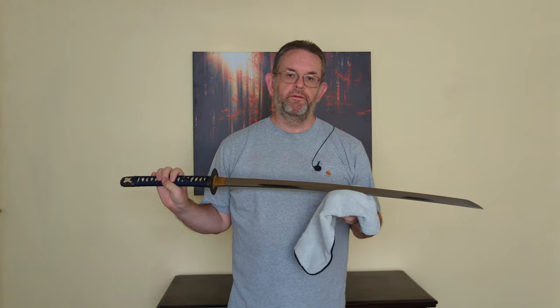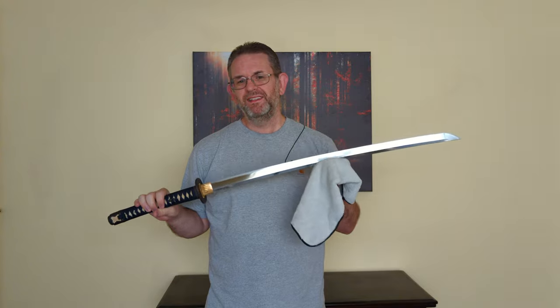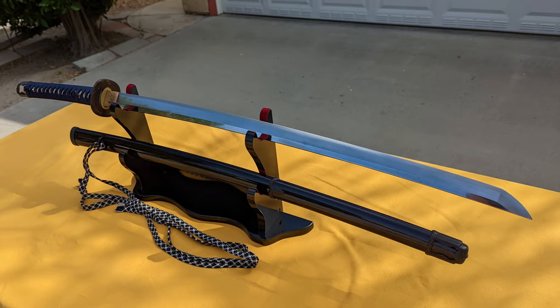Now, you don't have to go very far to find katana available online that are made from L6, but that's not really a big deal because L6 is not by itself anything special. The important part is the incredibly complex and difficult heat treatment process that Howard Clark has developed. It's that heat treatment process that creates the exceptionally strong and tough swords that Mr. Clark is known for. Without it, L6 is not much different than any other sword steel with comparable carbon content, such as 1070.